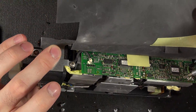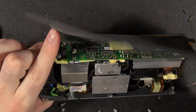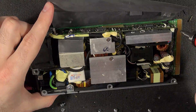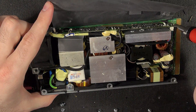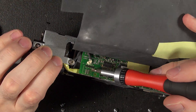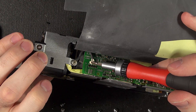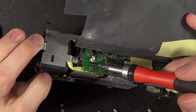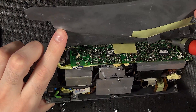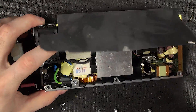The fan is controlled by a chip, and they use a jumper wire — apparently they don't have enough room to get traces across. They don't have enough room to do anything other than use this jumper to take wires all the way back, which then leads to a part that jumps the connections right to the fan connector. They've got little diodes for back-EMF protection from the fan noise. There's an incredibly large number of links going up to the top board — all kinds of monitoring.